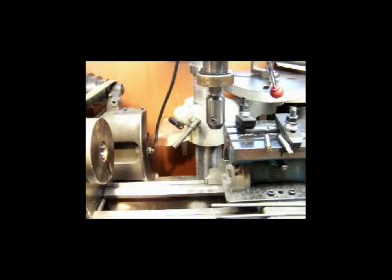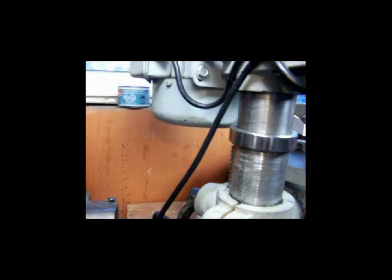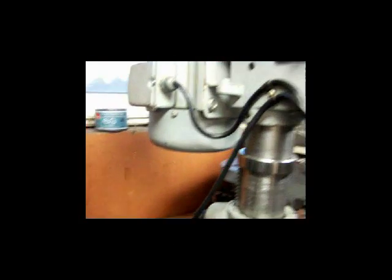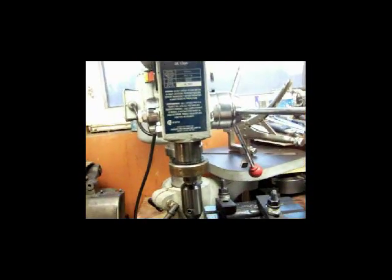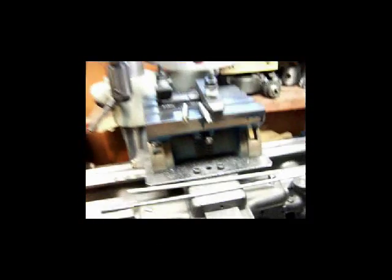This pipe, which I showed before, goes down to the base — it screws into that base, comes up, and locks up here with two set screws in the top. But I'm going to change that to a lever-type set screw so I can lock the head, and I can take this whole head and turn it off of the center of the lathe and push it to the right.